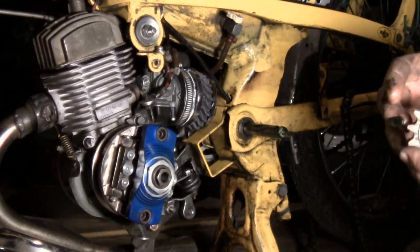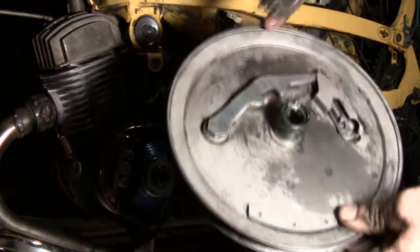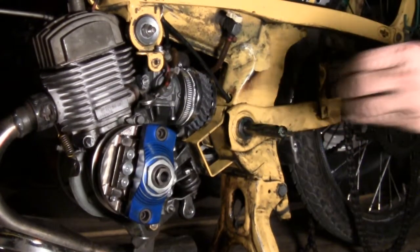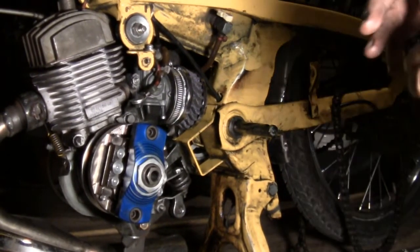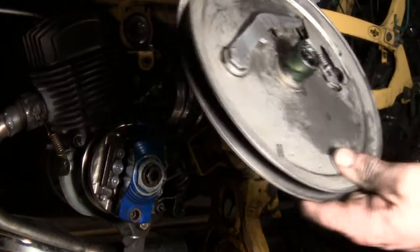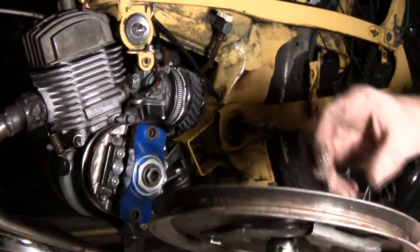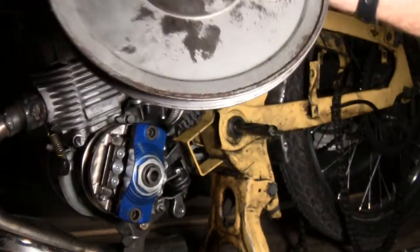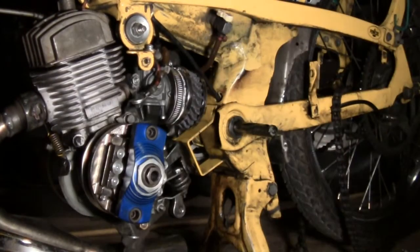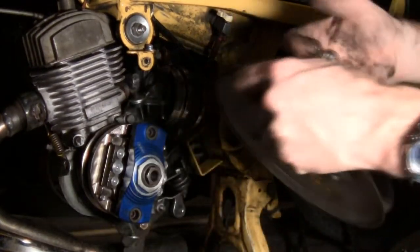This is the larger sprocket I'm going for. The fatter side is the side that's going to lock against this clamp, and the thinner side is where the chain is actually going to go, so I'll put the thinner one facing in. I'll go overkill with some grease again. I'll put the fat teeth toward the pulley and make sure I'm in bicycle mode — or 'V for velo' I guess is what it stands for. There's a channel in there I've got to make sure is just full — a little hollow between those two bearings.